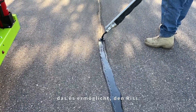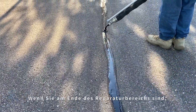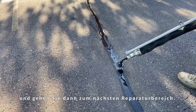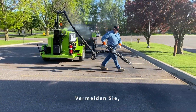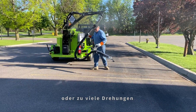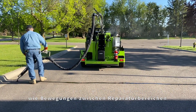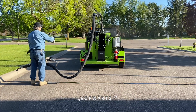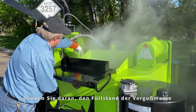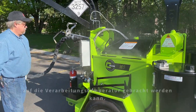Follow the crack moving at a pace that allows the crack to be filled and sealed to level with the road surface. When you're at the end of the repair area, lift up the trigger and close the valve to reduce dripping sealant outside of the repair area, then move on to the next repair site. Avoid walking under the boom too many times and twisting up the hose — a significant kink or too many twisting rotations could cause damage to the hose. It is a good idea to make a plan with your crew on how to clearly communicate movements between repair areas, as clear and concise communications will keep your crew safe and more efficient. Remember to keep an eye on your sealant level in the material tank so as not to run low on material.